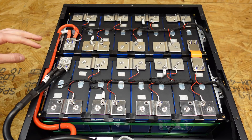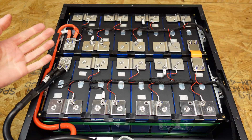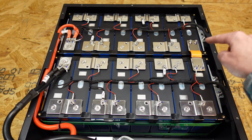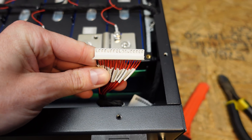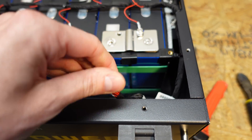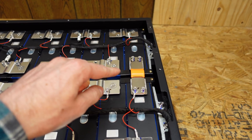This is a 48 volt battery and there is a lot of exposed metal here, so there is a risk of being shocked. For that reason I don't recommend people open these batteries up. Before proceeding, I'm going to remove the series connector to reduce the overall voltage on these battery packs, and also remove the balance lead connector from the BMS to avoid any unintended voltage spikes when removing that series connection.